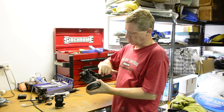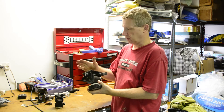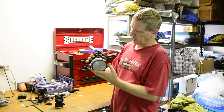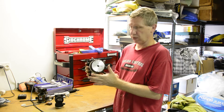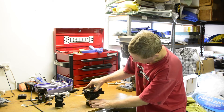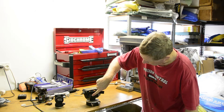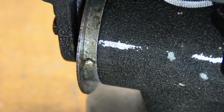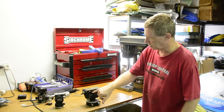I've done everything I wanted to do. I've got the much bigger handle here at the end just to nip it up, so the tray locks down to it. I've got the 5/8" tapped hole here, so it bolts directly onto the surveyor's tripod. Another thing I've done just to improve the tilting — I've actually drilled two holes either side and tapped them with M3, and I've got two screws going through just to lock this in.